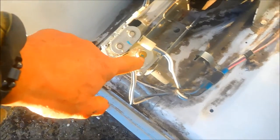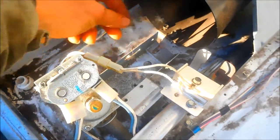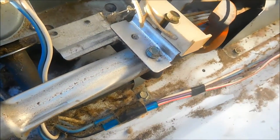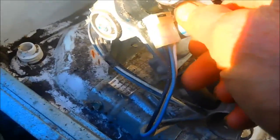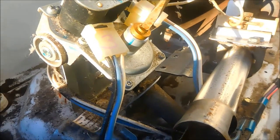What we're going to do is replace the diaphragm nut screw adjustment and then the jet inside here. Once you've taken off the two holding screws, this will come off. Be very careful with the igniter — it's kind of like made of eggshells and it breaks very easily. Once you've taken that out, you will loosen the jet here and remove it, and also the diaphragm screw.